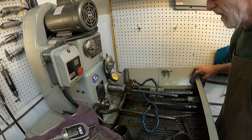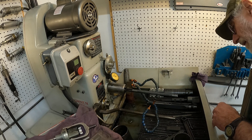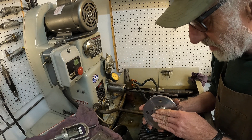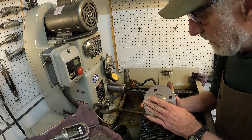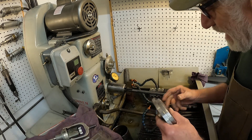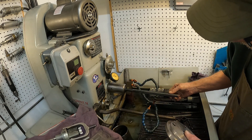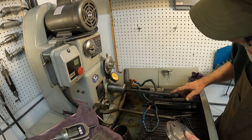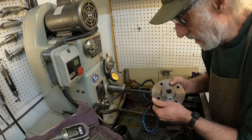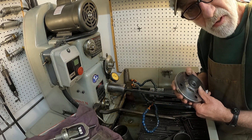What I have to do is put a bronze bushing in this milling machine support for an arbor. I'll press a bronze bushing in here, and the size of the bushing is 0.718 inches. That happens to be the smallest size of this mandrel I already had. It's a long mandrel that uses three stones — that won't be a problem. It'll be a fun project.